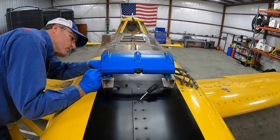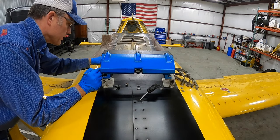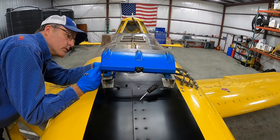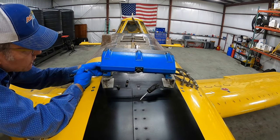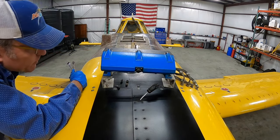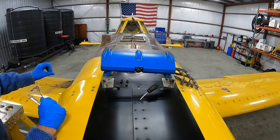This is called the light bar. This is what guides us across the field. It'll keep you within a one foot increment. So if you're even one foot off your line, it'll tell you that. So that keeps us in line going across the field. No, we don't have autopilot to steer across the field for us, although that would be wonderful. I think there would be other problems with that. You're too close to the ground to be having autopilot trying to steer you across the field. You need to stay in control of the airplane when you're that close to the ground.